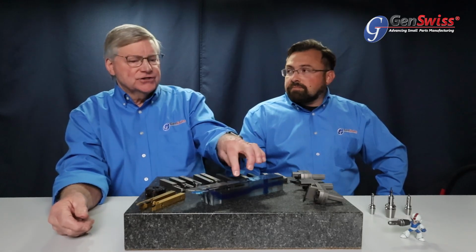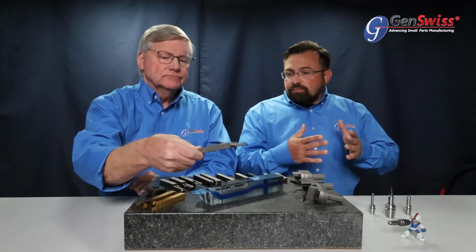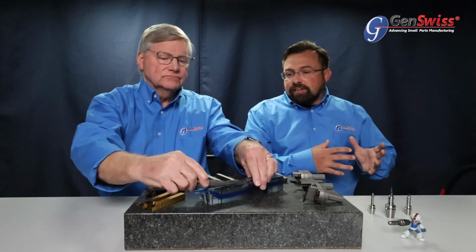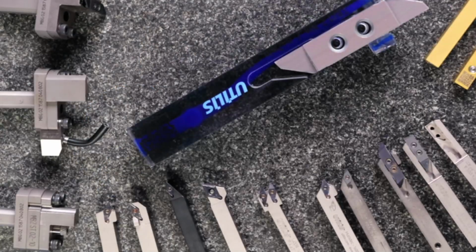There's no bearing surfaces anywhere that is going to disrupt any of your cutting angles. The bearing surfaces are clearly within the insert. Yes, it's designed to not utilize the cutting edge as a datum surface for locating the edge of the insert itself. So all that is clear and relieved away so that the cutting edges are not touching the holder at any time on the 3000 series.